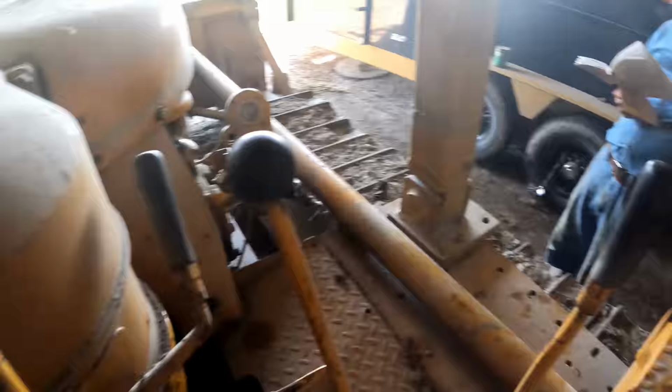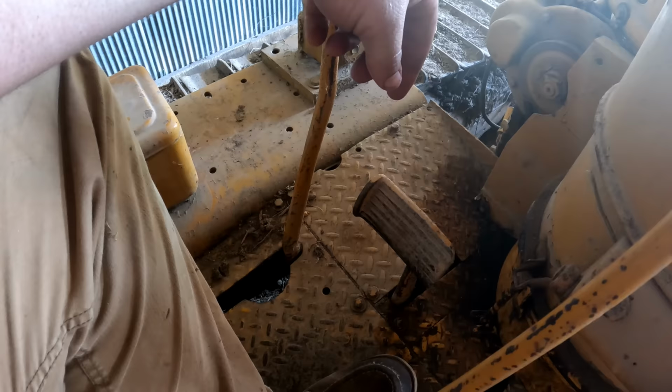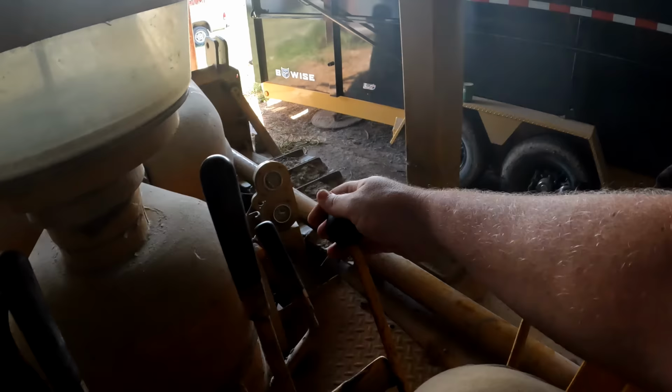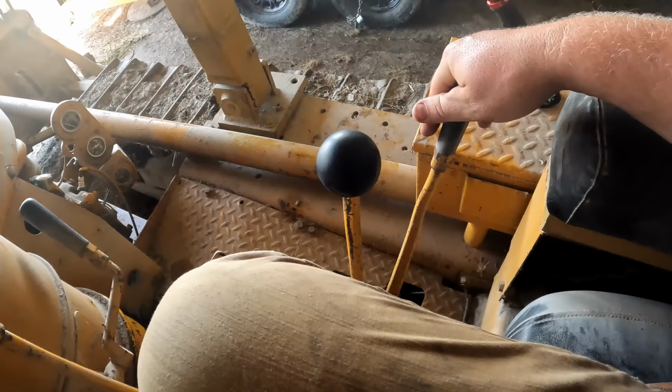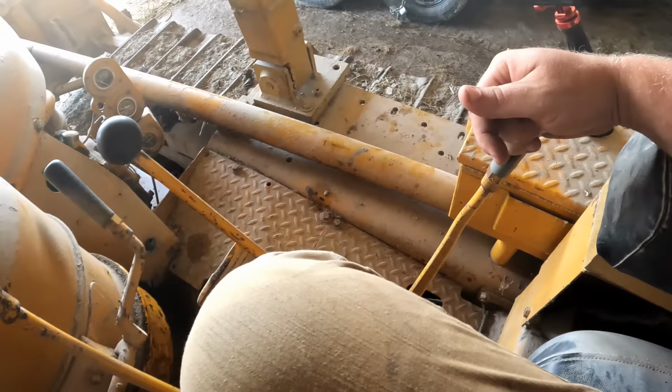I wonder if it's like there's a panel right there that we could look down in there with some 9/16ths. I'm honestly wondering if we got some linkage and I'm not being able to push that forward far enough to get it to slow down so that I can actually put it into gear, because like here it's in gear, guys. So you've got first be able to take this, and this should go forward. That's reverse, and that's forward in that gear. And then that's the neutral, where you should be able to do this and put it into a gear. And that should go forward. Except we're thinking it's not clutch braking.